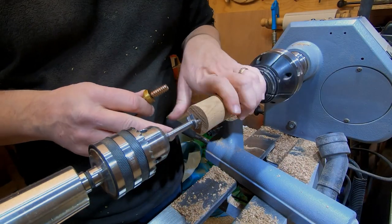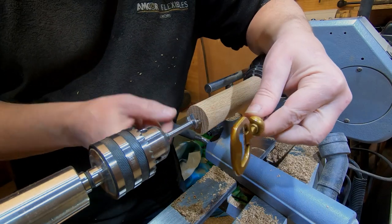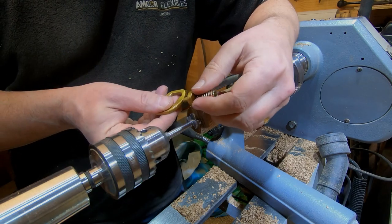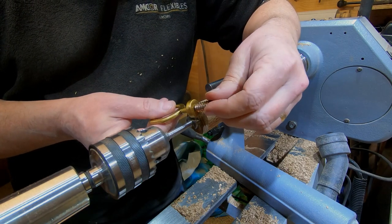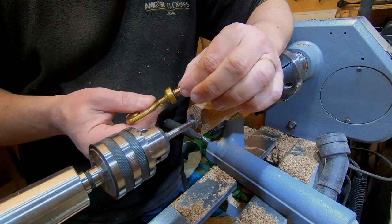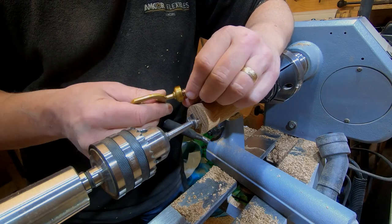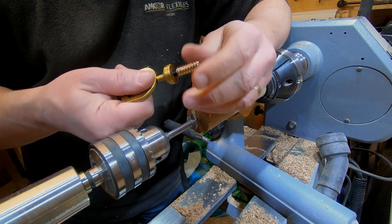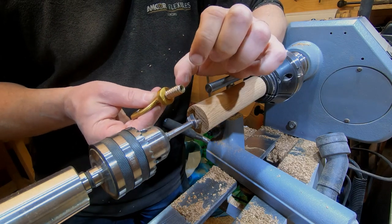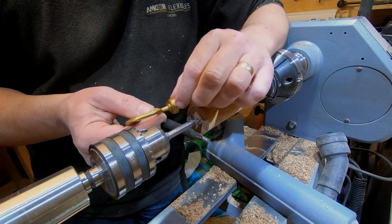Now, I'm going to follow the guide they put on the ProKraft website to make these. So I've got a 20 mil forstner bit in here to start with, which is what I want to sink in. As I said, we've got a 10.5 mil thread there, so we'll need a 10 mil hole. The thing you need to make sure of is that you get this thread hole right first of all, because if you start screwing this in, the chances are you're not going to get it out again, because this is actually screwed onto another bolt inside. So it's better to make sure that you go a lot deeper for this than is required with your 10 mil hole.